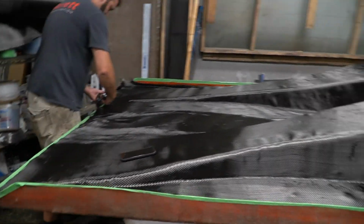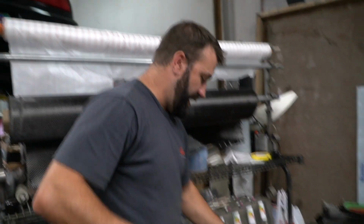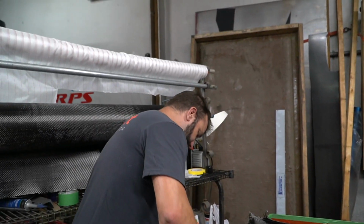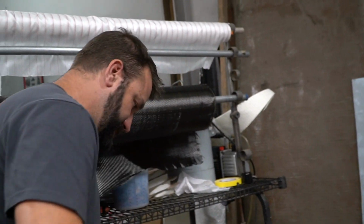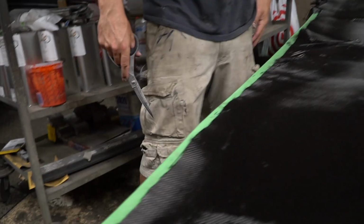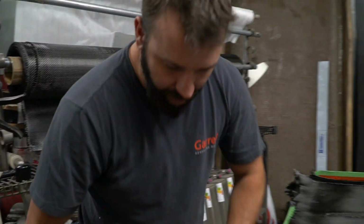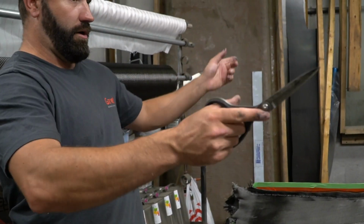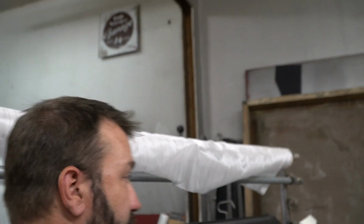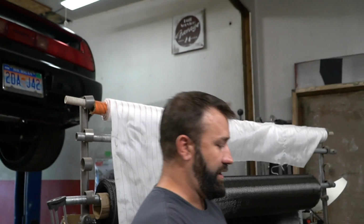All right, now it's all laid out. Cody, what do you have to do next? Cringe, because I hate this. Yeah, he's been flicking it all over. Yeah, so next, trim the tape edges. I'm going to have carbon fiber hanging over the edge. And then go all the way around. And then peel ply is next. It's laid over it, taped down on the edge. Flow media, then bag. But that's going to take like the rest of the night.